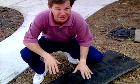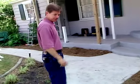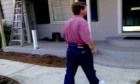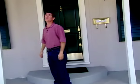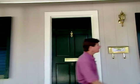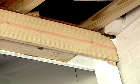They're in pretty good shape. We're gonna try to match up the best we can with these old shingles, but they both kind of fade together, so it's not really a major if we don't match up perfectly. But things are looking good in here. What we've done also is our patch and repair with the rotted wood. You remember that? Now we've got some new wood in there. We'll come and caulk and secure some of these lines and paint over that.